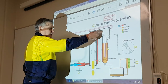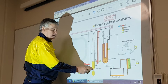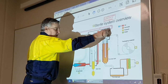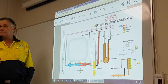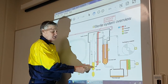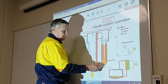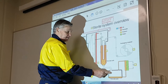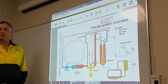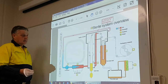Then, out of the packaging material, we come through the drying chamber, air knife, and we form a tube — a tight tube — and make a seal. So now we say that the aseptic chamber and drying chamber is closed. The sterile air system is closed by pulling a tight tube. The peroxide bath is used to sterilize the material, and the peroxide bath is fed from a peroxide tank. We heat up the peroxide indirectly by a water heater — we do not heat the peroxide directly.